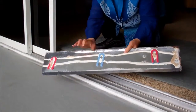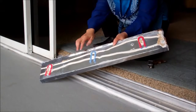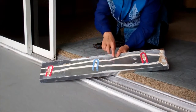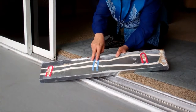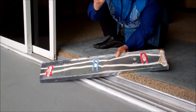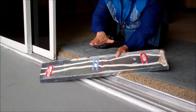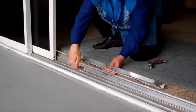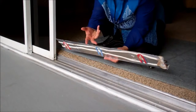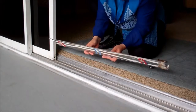The other problem we noticed when we took it off was that whoever installed this door put a series of shims and then just slapped a little caulking on there. The problem is this caulking is not mashed down. If you understand how this is supposed to work, the shim gave enough air space underneath that the caulking did not settle down onto the floor. Thus, there was an air pocket underneath the track, and water could have intruded at any time. If there was a serious storm, we could have had serious water intrusion. Bad idea.